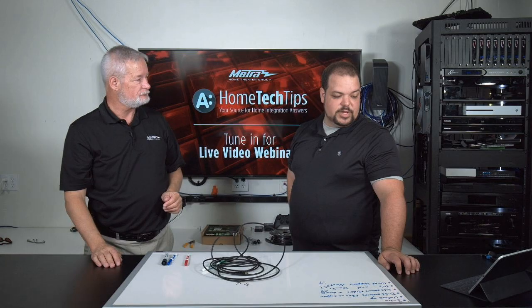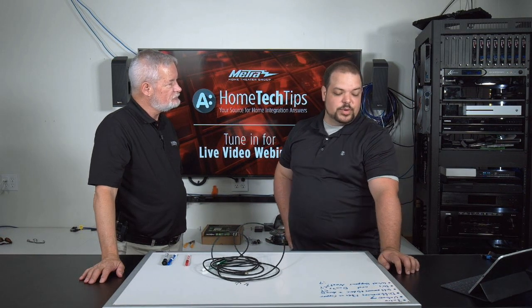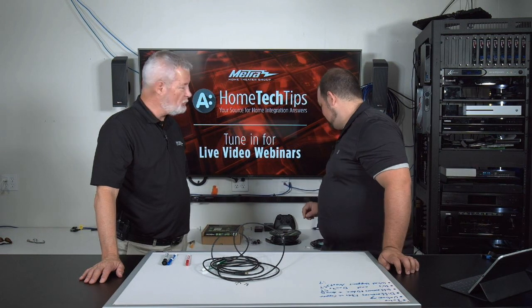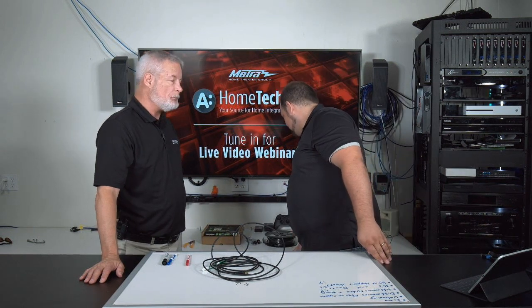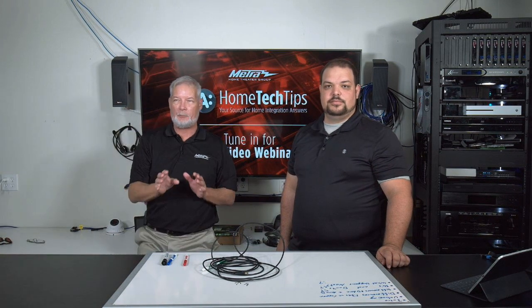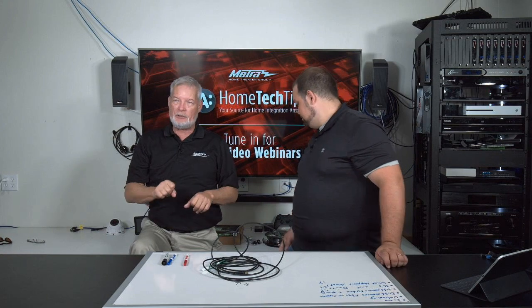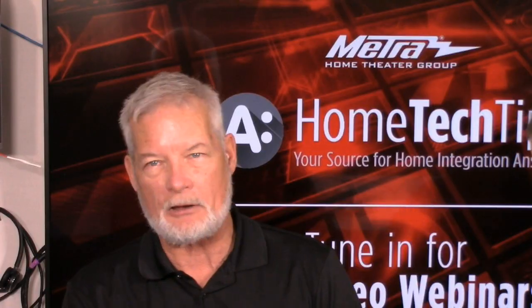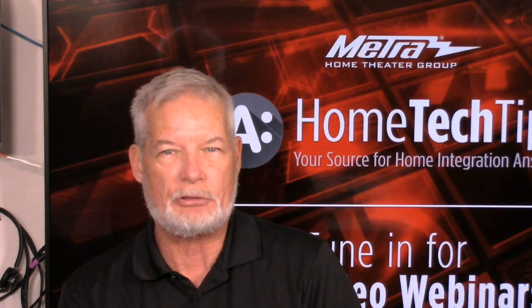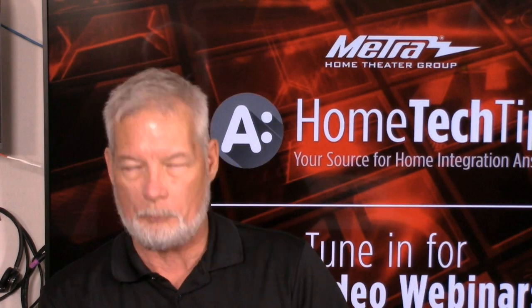So Brent, we actually wound up getting a couple more questions. Good. The first question is, what is the pull weight limitation? I don't have that information, I'll be perfectly honest with you. I wrote it down somewhere and didn't think to check, but you should treat it exactly the same way you do any network cable installation. That means you need to have a 6-inch bend radius. That means you do not want to yank it across the attic as you're running across the headers. I highly encourage that you use the little nylon pulleys when you're doing fiber, whether it's an AOC cable or a bulk fiber.